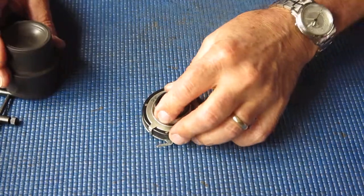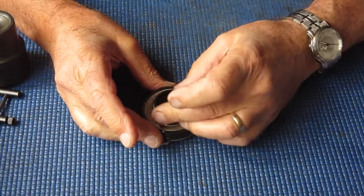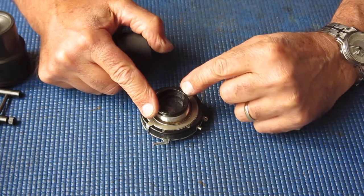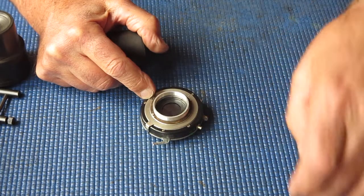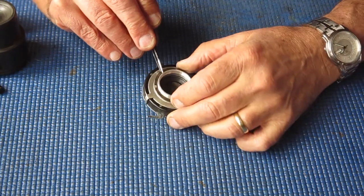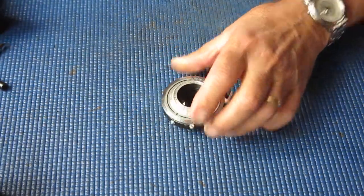I'll see if that'll come off with a friction tool. The friction tool is always preferable for unscrewing a lens like that if you can. You want to make sure it's dished in some fashion so that it contacts the outer metal rim and doesn't touch the glass. We should be able to lift off the shim — looks like two shims by the looks of it. Back to the front.